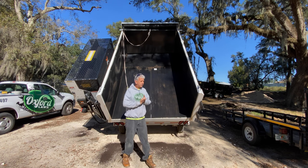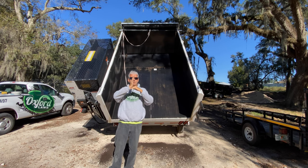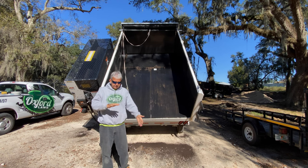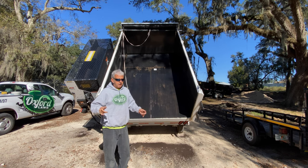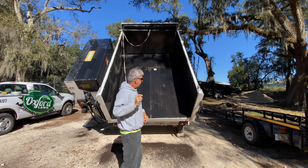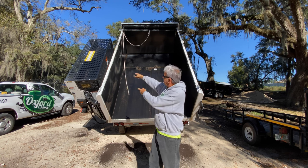I'm going to stop this video here — I think we covered all the aspects. Florida sun! You've seen it all: how the valves work, where they're located, the axle lift, the hydraulics, the beefy brackets, the beefiness of the trailer. The dump angle is much higher than a standard dump trailer. The axle lift — you have to get it if you're going to be doing top dressing, because top dressing machines are very tall. You need a big hopper since it empties fast. Yes, it can be used as a regular dump trailer — the MulchMate just swings up and out of the way.